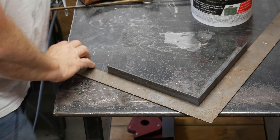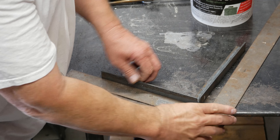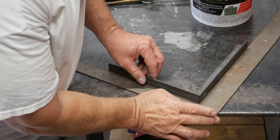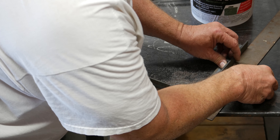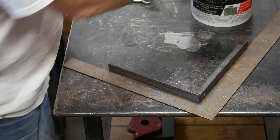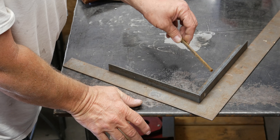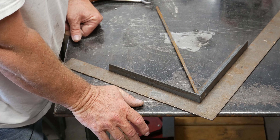Okay, here's what I got. I just cut some angle iron roughly at 45 degrees, and we're going to put it together here with my framing square. Then what's going to happen is I'm going to weld in this little piece of square stock, basically to sit in here just like this.